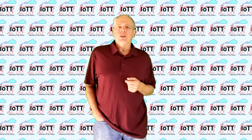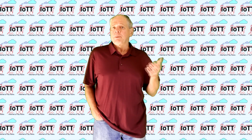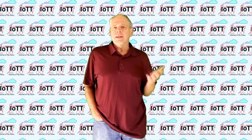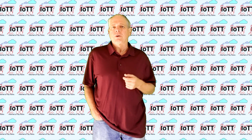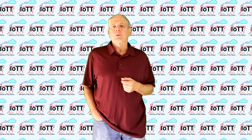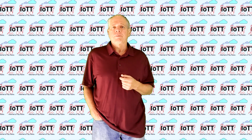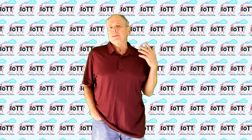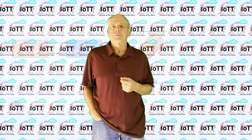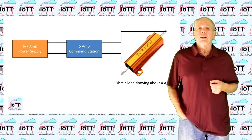The main advantage of the regulated power supplies is that thanks to the quite big internal capacitors, they typically can provide a brief, short circuit current pulse that is significantly higher than the nominal output, even if they are operated under nominal load. As discussed before, this is a precondition for reliable short circuit protection. And here is a simple way how you can test your setup.